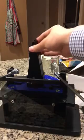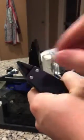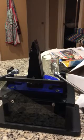That can be really useful compared to the older design, because the older design has no tension adjustment and is just a simple on-off. So when you would try and clamp a really thick blade, if it would fit, it would be really difficult to overcome that detent in the clamping mechanism to get it engaged. Whereas with a thinner blade, like a slip joint folder, a traditional pocket folder, on the old style clamp, because there's no tension adjustment, they had to balance it in a middle point, and that ended up leaving you with not very good clamping force on really thin blades.